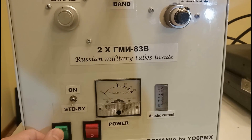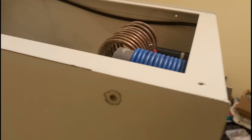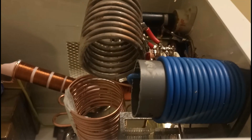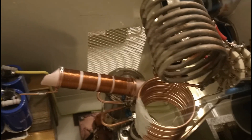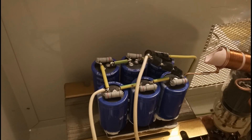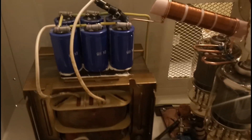Let's watch a little bit how it is built. In the meantime I am starting the heater to heat the tubes. We'll open the amplifier. As usual, the amplifier is built using a doubler high voltage power system. For these tubes I am using only 2100 volts in the idle mode, but those tubes are capable to withstand much more than that.